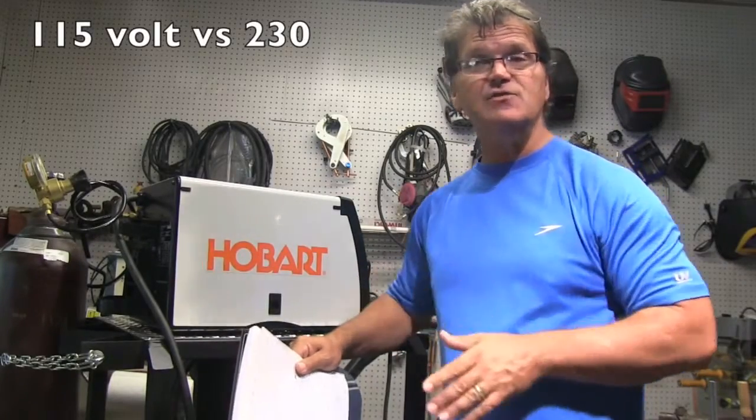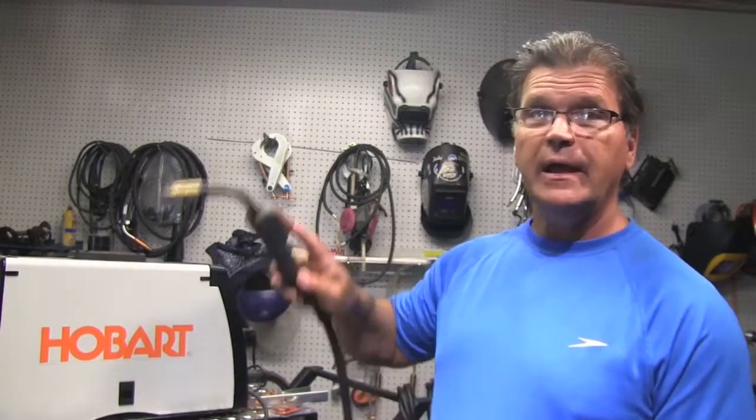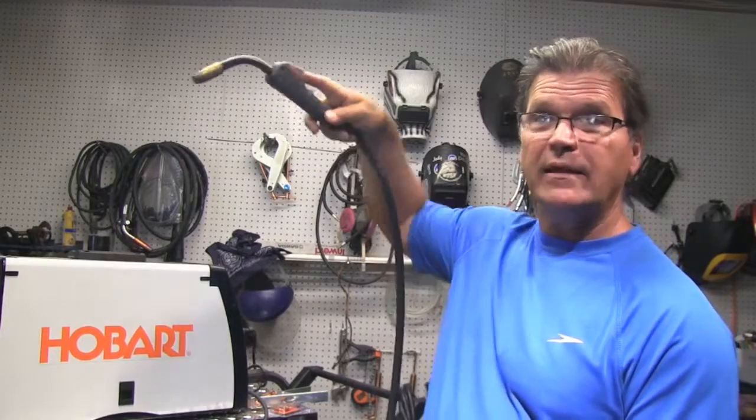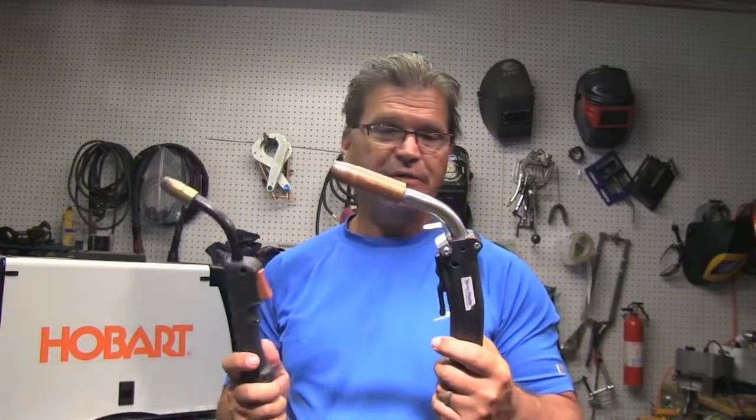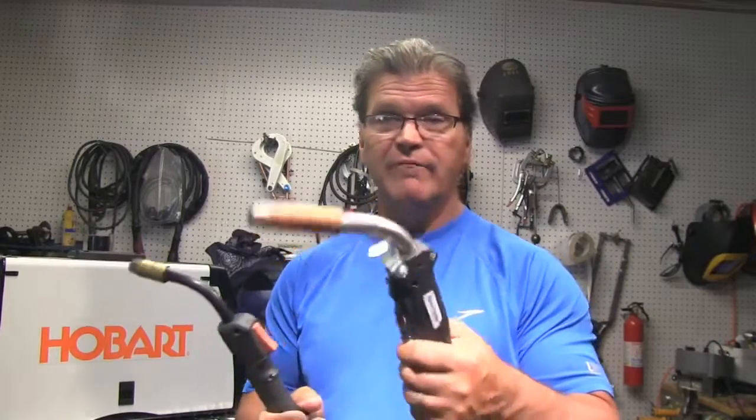Is a 230 volt welder better, and if so, why? A 230 volt welder is not necessarily a better welder — it's just got more power so you can weld thicker metal. If all you're doing is welding exhaust pipe and mufflers, a small welder might be as good or better. One thing I like about small MIG welders is small MIG guns. If you're doing muffler work all day long, it would be important to have a nice small, lightweight gun to reach and maneuver easily in tight spots. Compare the Tweco gun that comes with the fabricator — a higher amperage, really big gun — to the small gun that comes with the little Hobart 210 MVP. One feels a lot heavier and bulkier; the other feels tiny and maneuverable.